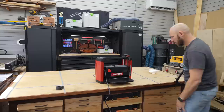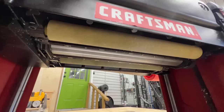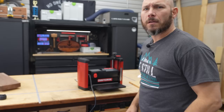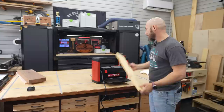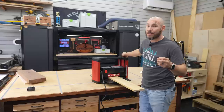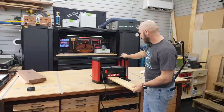It's not terrible — that wasn't really terribly loud. When you start putting wood through there it's going to get very loud. There are powered rollers underneath that help pull the wood through. We're going to plane some spruce, some walnut, and some hard maple just to see how it performs. I've also got an epoxy serving tray to run through and see how it handles epoxy buildup. Typically you never want to take off much on each pass — even on the 735X I never take off more than an eighth, and usually it's less than a sixteenth. Just tiny bites; it'll make your blades last longer and puts less strain on the machine.